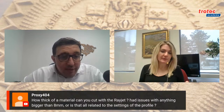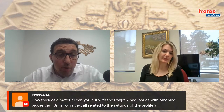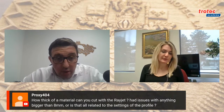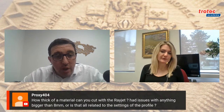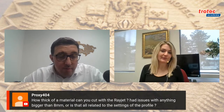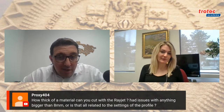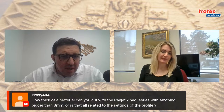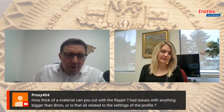And Justina, you can add to this, but the Rayjet, cutting 8 millimeters is already very thick for a Rayjet. The 100 usually, if you do multiple passes, if you have enough wattage, you can cut 8 millimeters. If you're looking to do a one cut pass, you need something like an 80 watt or 100 watt or 120 watt Speedy. Correct me if I'm wrong, Justina, what's the highest wattage the 100 comes in?